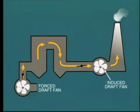A different situation would prevail if the boiler was being taken out of service for maintenance. In this case, we would run the ID and FD fans so as to purge the boiler of gas and also to force cool the hot metal and refractory. Even when the pressure falls to zero, further cooling would still be necessary for some time after, so as to allow personnel to enter the boiler.